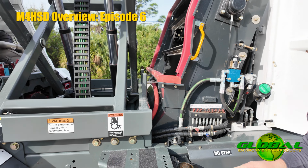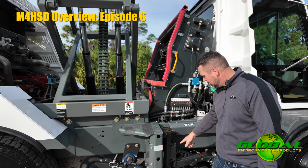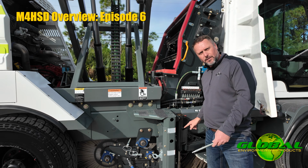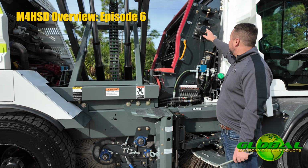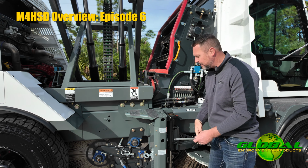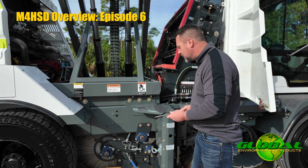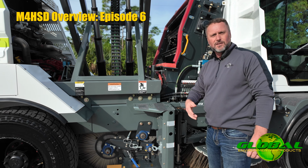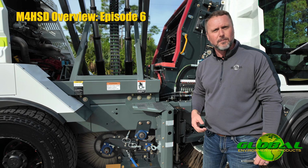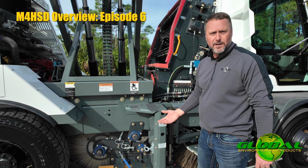So again, that's your 9 points. Left and right hand gutter broom dish are 1 and 2. Left and right hand float cylinder are 3 and 4. Left and right hand upper bearings, left and right hand lower bearings, 5, 6, 7, and 8. And number 9 is my pickup broom bearing. If you can keep those greased, this machine's going to go out on a daily basis and continue to pick up dirt as it should be without any kind of premature bearing failures, okay?